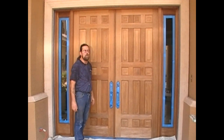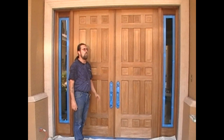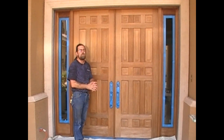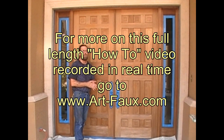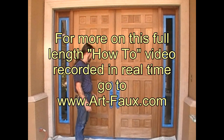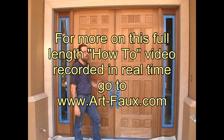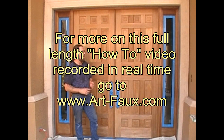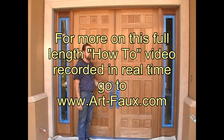Now these doors were a real mess. I went ahead and stripped them, sanded them, and prepped them out. If you have doors like that, I recommend a stripper called Dad's — you can get it at your hardware store or Home Depot. The key thing is prep. Prep is everything when it comes to doing stain work. You want to make sure you get your doors nice and clean.